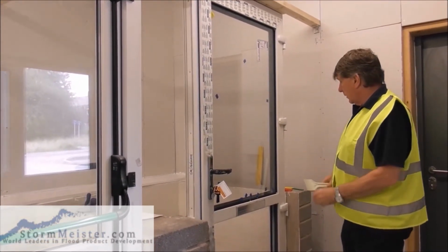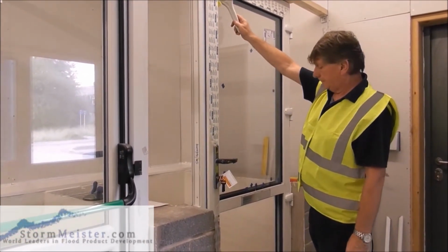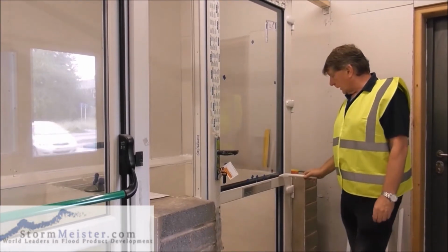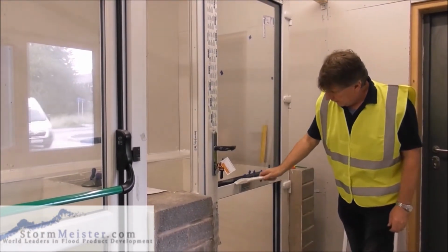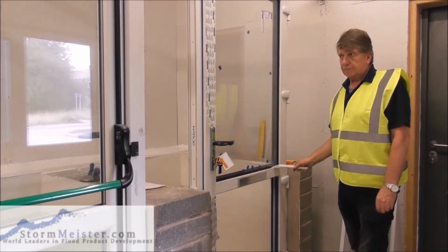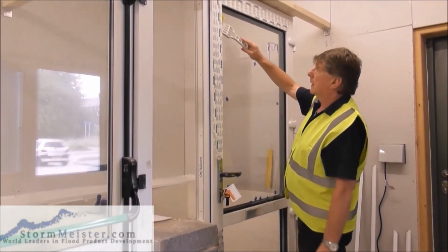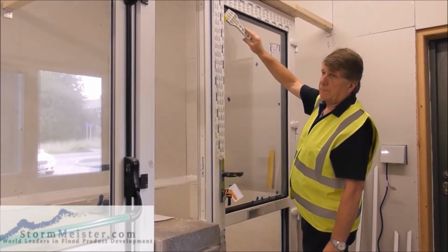Right, so we've now got the heel here, we've got the toe here. So the weight of that glass is entirely on here because there's nothing there carrying the weight. All the weight is on the heel. Okay, and we stop the glass kicking over by putting the toe there.